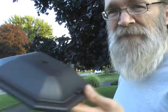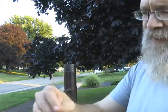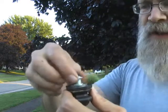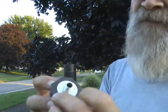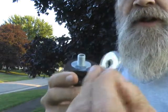The top here needs a finishing touch, which they call a finial, which they shipped separately to save space in the box and make less chance of being damaged in shipment. They put this in with that bag of goodies that I showed you earlier. Okay, it's pretty simple. It's just finger tight. We have a nut, and here is a lock washer. The lock washer helps resist it from loosening up on its own. Then we have just a regular flat washer, and that distributes the pressure so that it doesn't deform the plastic top.